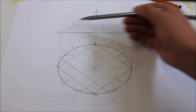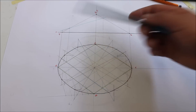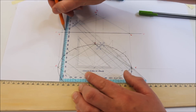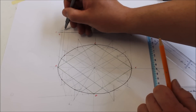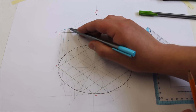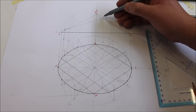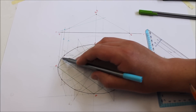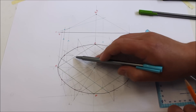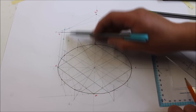Now to show where that point finishes or stops on the curve, on the outer side of the hyperbola, you're projecting it up from the curve in plan. You're projecting this point straight up to the A-D line, projecting the other end up to the B-C line, joining them and extending out till it reaches the curve. You can do the same with the rest of the elements. Where each element crosses AD and BC, project them up, join, extend, and where it hits the curve, project that up and you'll get another point on the curve.